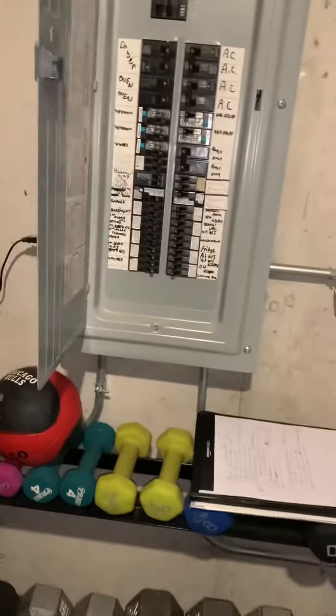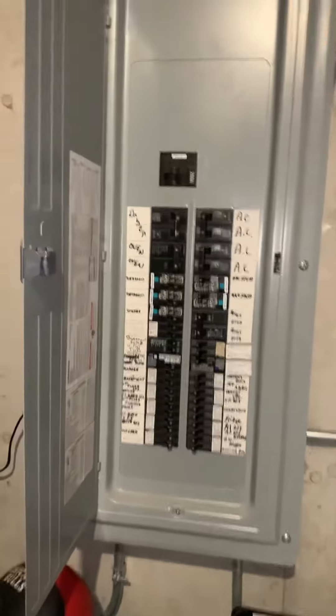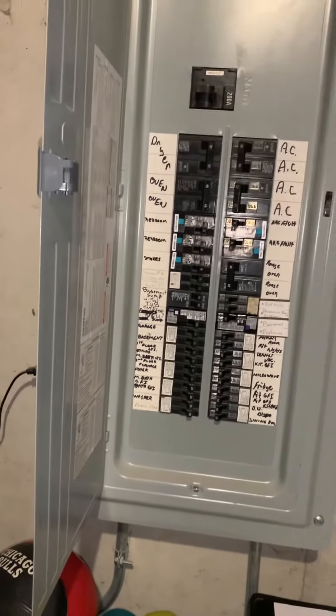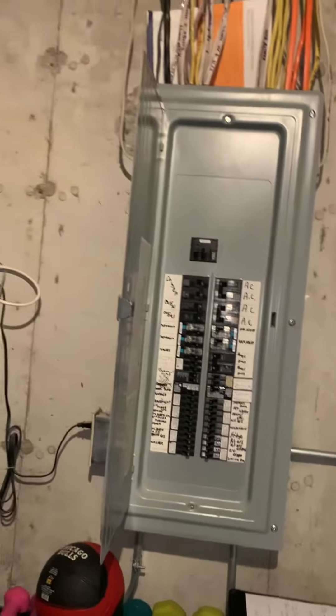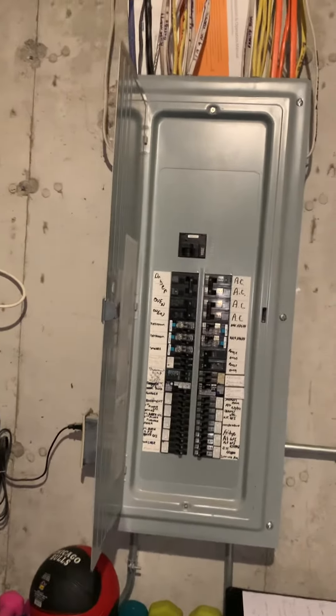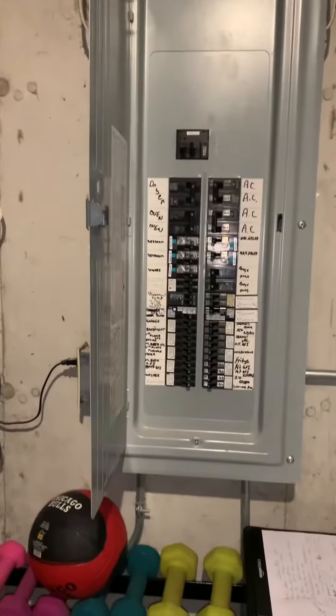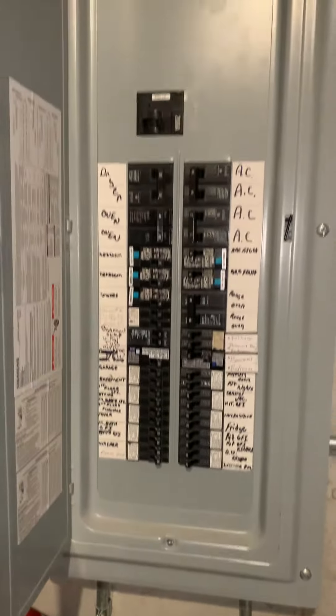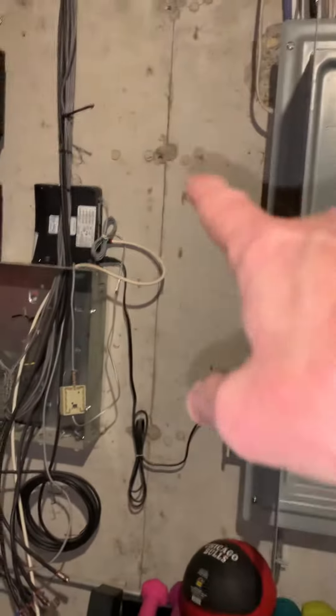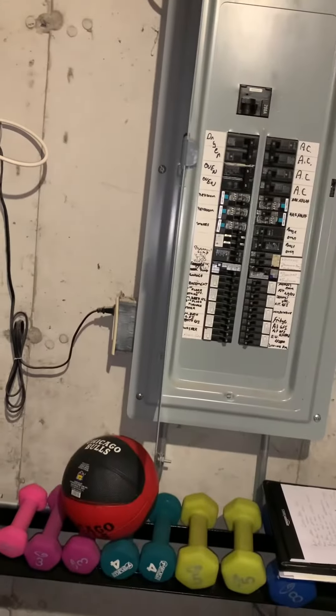And then we have a walkout over here, and here's our panel. The thought was trying to get a mini-split for the second floor. At 200 amps we can get you up there, but we're probably going to have to do a sub-panel because of the situation we're in here. We're probably maxed out on the tandem breakers, so something's going to have to come off right here and then run over to the outdoor unit.